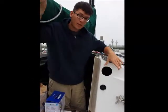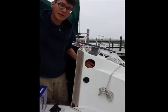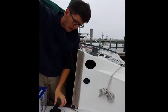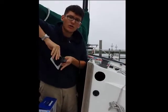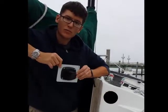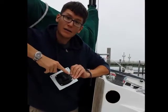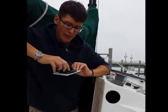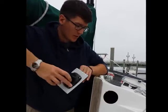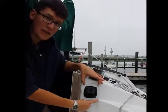When I pulled out the old speedometer, I expected to have a small one-inch hole. Instead, I had a big four-inch hole. So I went to Sailor's Exchange, a local store here in St. Augustine that has a lot of great parts. I got a piece of fiberglass that came out to the right size, mounted the bracket for the sonar to it, and I have 5200 silicone sealant on there as well. This is going to cover the hole, and I'm going to screw and seal it onto the boat.